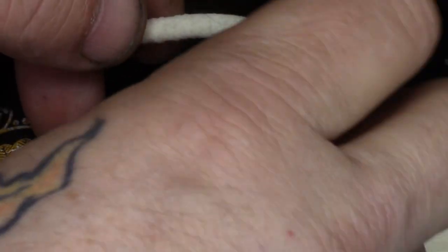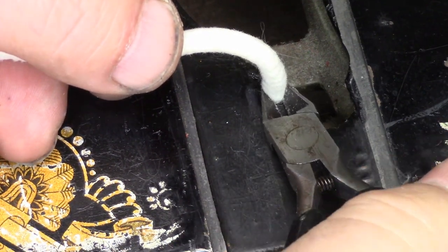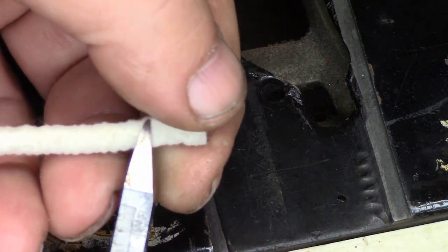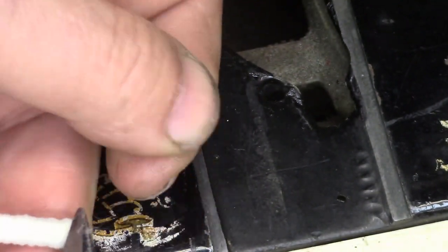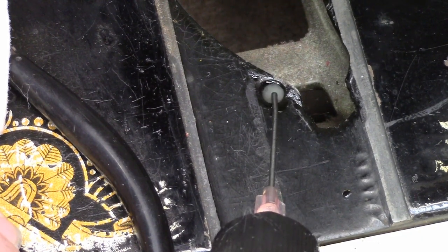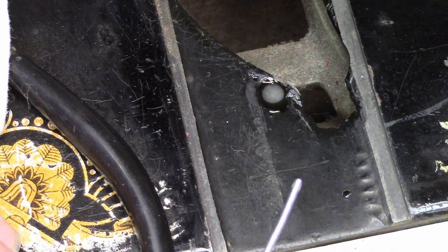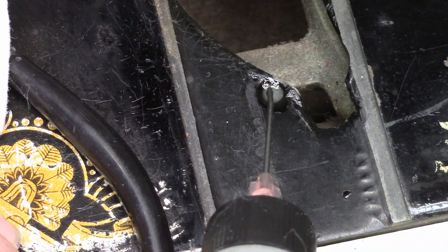What you can do is insert the wick all the way into the hole, then pull it out using the diagonal cutter. I'm going to back it out just slightly — I want maybe a 64th of an inch — cut it, and put it back in the hole. This way it goes down just slightly below the top of the surface. Make sure it's seated, and when we load this up with sewing machine oil, I'm going to give it a few drops and let it soak in completely. You want to do this until it stops soaking.